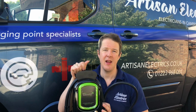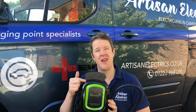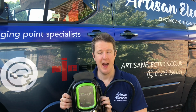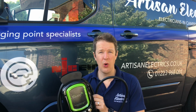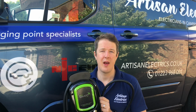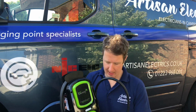So essentially the national grid are able to ramp up or down the amount of power that these things are consuming, so that if they're worried about the grid getting overloaded they can just ramp them down a bit and stop them from overloading the grid. So this is a new thing now that since the 1st of July all OLEV grant installs, in other words if you're installing an electric vehicle charging point under the OLEV grant scheme, you have to install a smart charging unit, and so Rolec have produced these units in order to comply with that regulation.